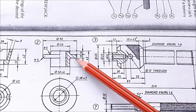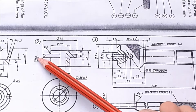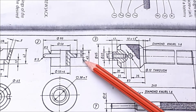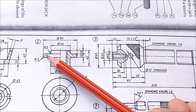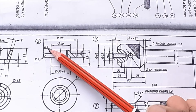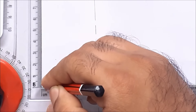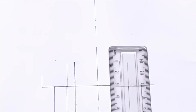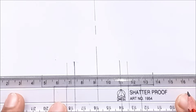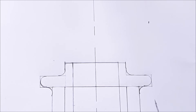Now let us draw these edges. The total length here is 90 mm. From the center, mark 45 mm and 45 mm, then mark a height of 10 mm and join up to these lines. Also, we have to draw an arc of radius 5. This completes part number 2, nut.